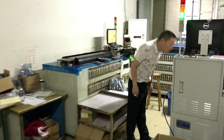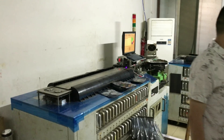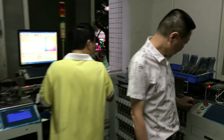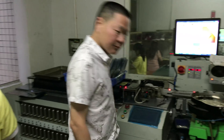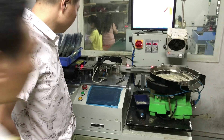After the packaging has been done, the LED will go to the binning machine. This machine sorts the LEDs depending on their color, light strength, and several other factors such as forward voltage. This is a very important thing, because it makes sure that you, as a customer, get what you ordered.